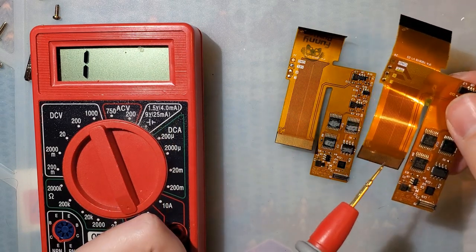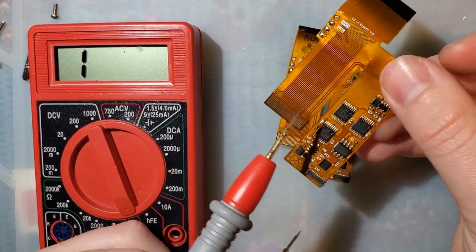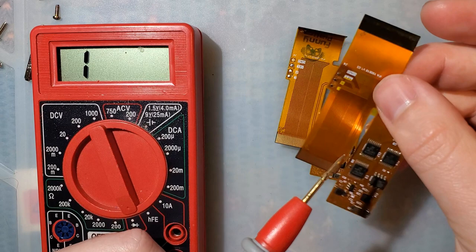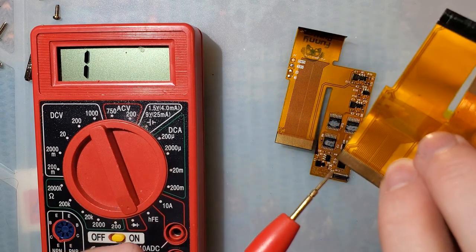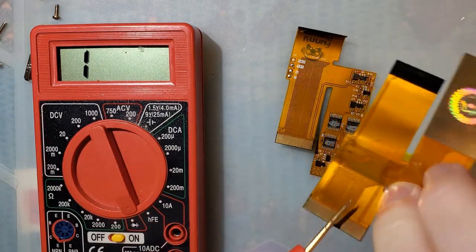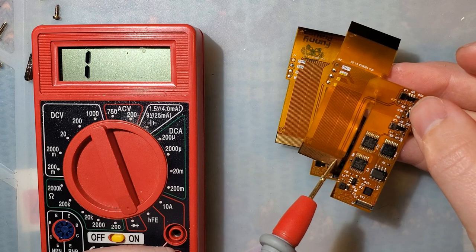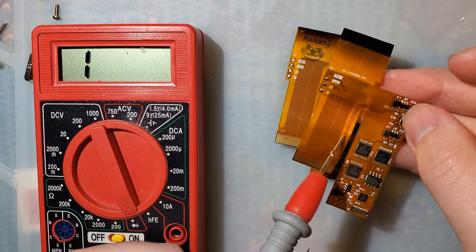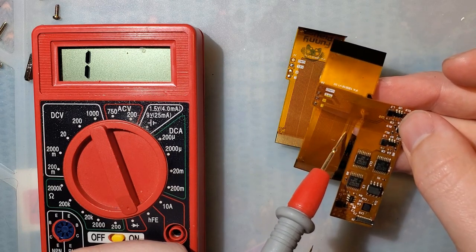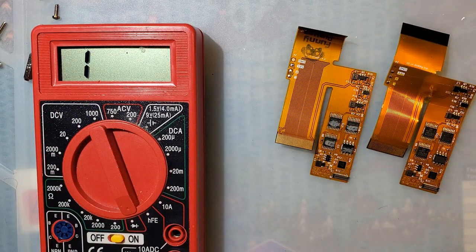And the reason I'm choosing to solder to this connector, because, well, A, it's right here, it's so much easier, but the biggest reason is because of this power line right here that is still intact on the other connector. It's not intact on this one, and there is no place to solder to it except right at the pin, unless I try stripping back some of this insulation on the ribbon, which I've never done before. I don't know if I can do that.